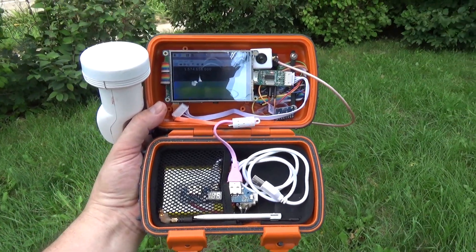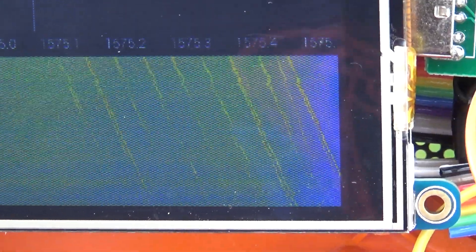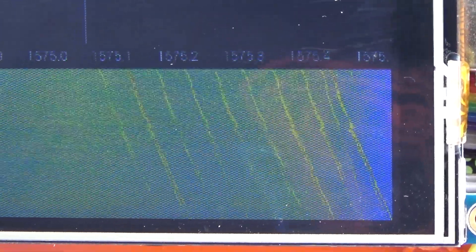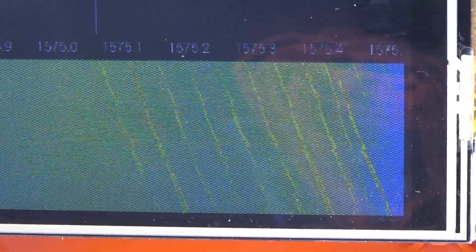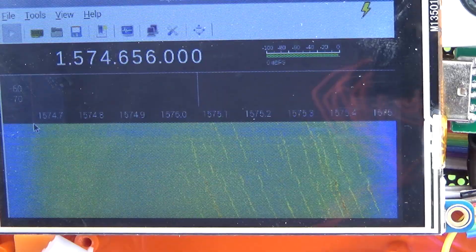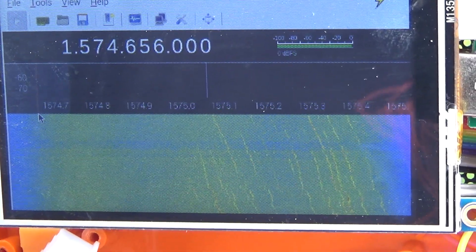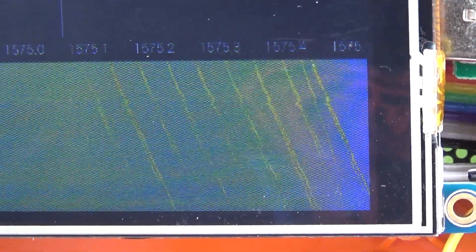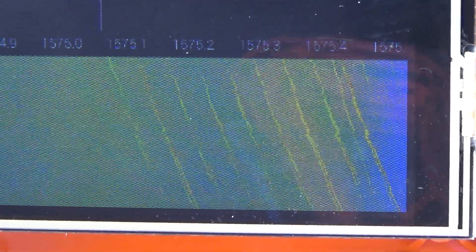It's working great. It's a little hard to see on the screen, but I'm picking up multiple satellite traces right now. That's probably a whole train of recently launched satellites going overhead — you can see they're spaced very close together, all moving at the same speed in the same direction, and we're getting some pretty strong signals. What we're seeing here are just the locator beacons from each Starlink satellite. All the internet traffic is on a completely different frequency range. These beacon signals just help pinpoint where each satellite is and help the ground station tune in as different satellites pass overhead. The beacons just happen to be in the KU band range, which is why we can pick them up with a satellite TV receiver.